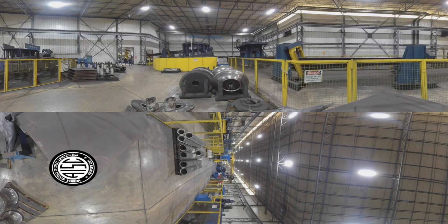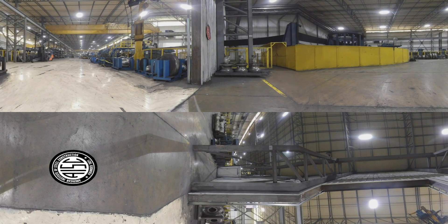The freshly welded sheet then moves through the line into the spiral accumulator, which feeds the coil to the forming rolls. You can see it behind the yellow fence at the corner of the shop. The accumulator, which holds several coils at one time, allows a continuous forming process.